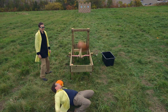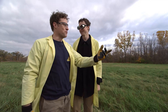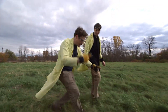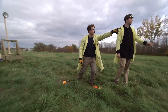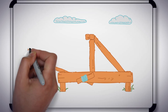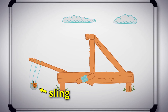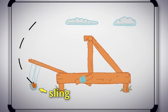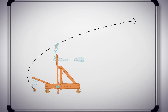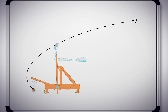One, two, three! It didn't work that well. It flew and it landed here, which is a little farther away from the wall than I'd like — only one third of the way to the wall! Now Zach and I are planning to outfit the catapult with a sling. The sling attaches to the end of the throwing arm and gives the pumpkin a lot more distance to travel. Because the pumpkin is traveling a longer distance in the same amount of time, it will be going faster, which will hopefully get it to the wall, or at least a lot farther than before.